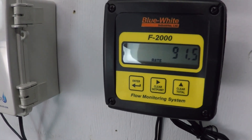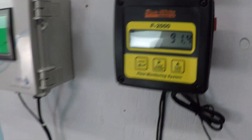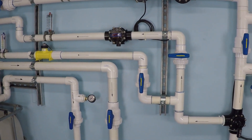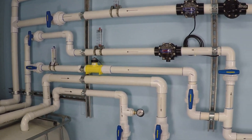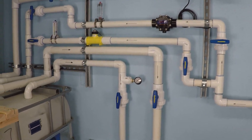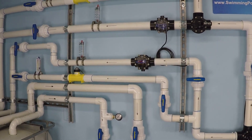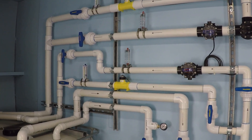That's interesting — I actually thought those numbers were going to be closer together. So 102 versus definitely less than 92. Just by changing from an inch and a half to a two inch, over just a couple of elbows and a couple of extra feet of pipe, it was able to make a 10 gallon per minute difference on the system. That's quite a bit, and that's without making any alterations to the suction lines — just changing a small component on the pressure side made a huge difference to the amount of flow. If you found that interesting, please like this video, subscribe to my YouTube channel, and check out my website swimmingpoolsteve.com.